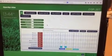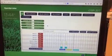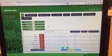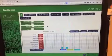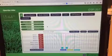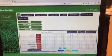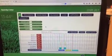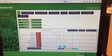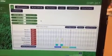Cool. This is all possible because I've implemented a new wireless network out here. I'm using mesh networking equipment, which is really cool because it allows us to expand out into all the greenhouses, though there are geographic constraints to what we're capable of doing. Cool. So that wireless network is the basis of what allows us to do this. It's exclusively for administration of greenhouse functionality. Nice. So it won't get clogged up with those pesky students in there. It won't get clogged up with anything unnecessary.